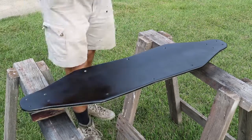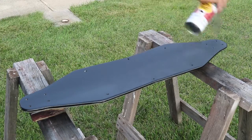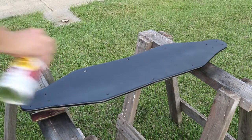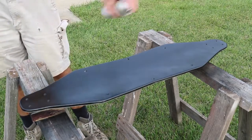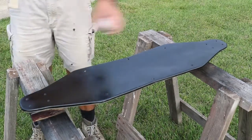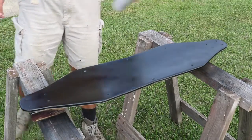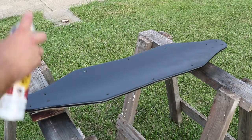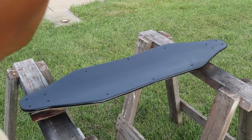Each of these coats are about two to three minutes apart, and I did two complete coats per side of the deck. When you're spray painting, you always want to make sure you're doing light strokes back and forth, never stopping or starting on the work piece itself, and always make sure you're the correct distance away as the directions say — that way you don't have any runs and you're not wasting paint.